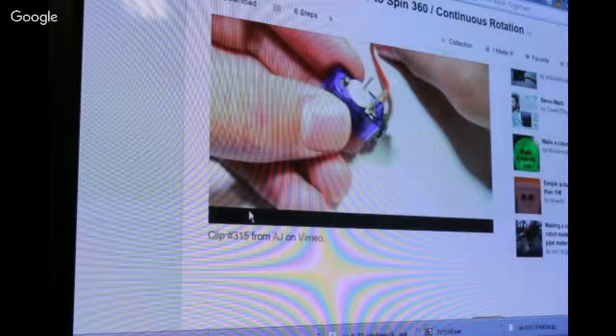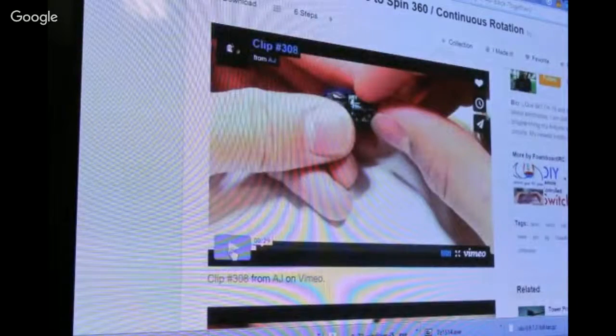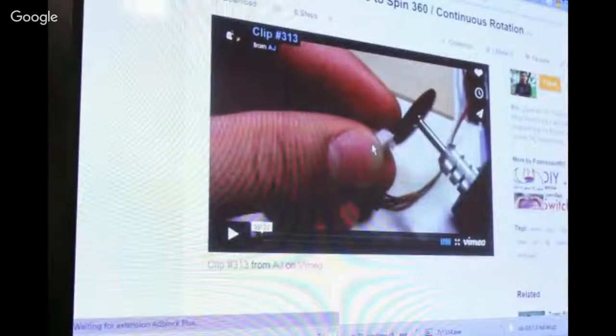Are you thinking of wheels or something? No, I was just curious, obviously this one is not going all the way around. Right. That's because it has a sensor to say where it is, so you're providing positional signals, and it only has 180 degrees of range to go with that. This whole Instructable talks about how to take the thing apart and make it go all the way around, and you have to do a little bit of soldering and cut it off with a Dremel.